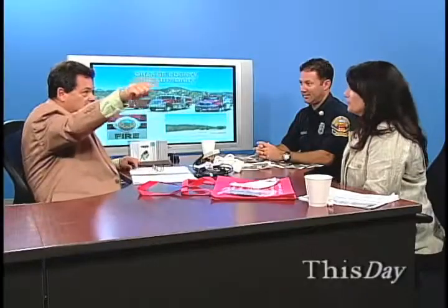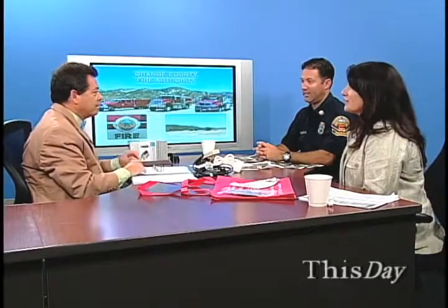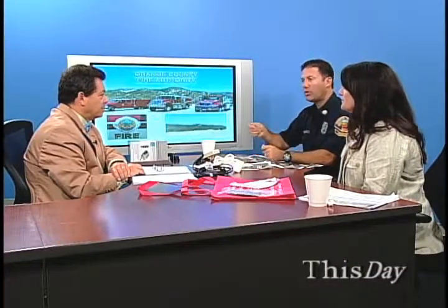Okay, that's a good thing, because I have a freezer in my garage, and I do have a 15-amp extension cord, but there's no outlet there. I mean, I have physically no place it goes to another outlet. See, that's where you might want to call an electrician to look at your wiring and rewire to put an outlet out there for that. Extension cords, again, should never be used in lieu of permanent wiring. They're just temporary.